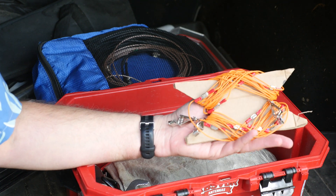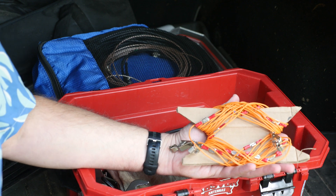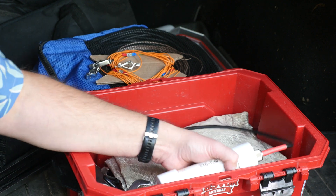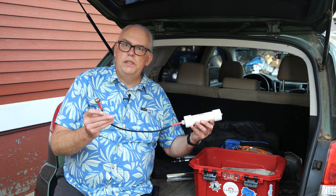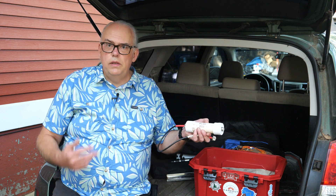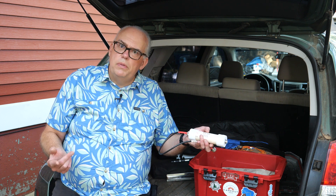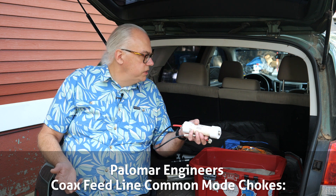Digging down in the bag, I've got the parts for my Poda Performer antenna on a cardboard wire winder — I haven't made anything more substantial yet. These are the elevated radial systems for the Poda Performer. I also have the MFJ-915 line isolator and a short piece of coax to attach that to the end of an antenna. MFJ is no longer in business, and these have gotten expensive as they've become more rare. Palomar Engineers is a really good source for coax chokes and isolators.